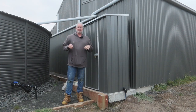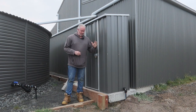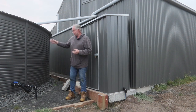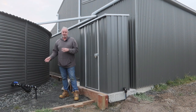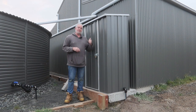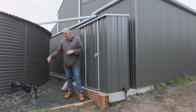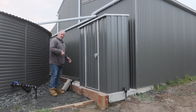I just want to give you an update this morning on the pump shed. We got this little shed and housed the pump and filter in there. Here's the large water tank — 108,000 litres. Down to my right there's a barrel filter, an inline filter that'll just filter out any of the larger particles before it gets to our filtration system in the shed. That runs along underground over to here, then it goes up and splits.